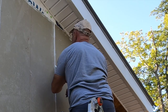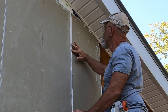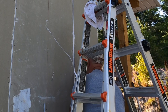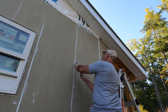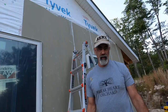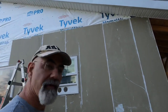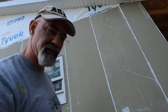Getting the fiber cement and vertical siding up is a bit of a chore, but it's only half the battle. Once you get it up, you have to seal the joints and put a coat of paint on it. All I'm doing right now is caulking the seams, then dipping my finger into some water and running it down to smooth it out and press it in to make sure that it fills the void completely.